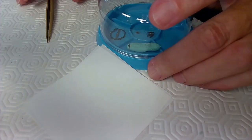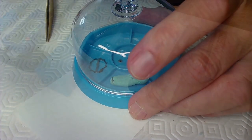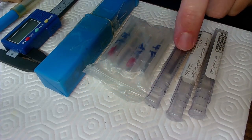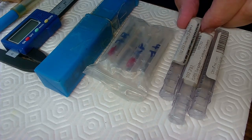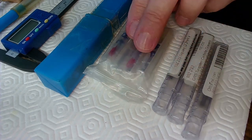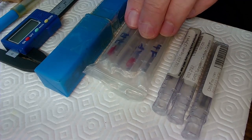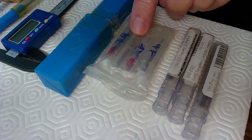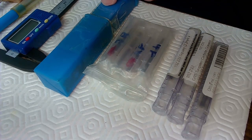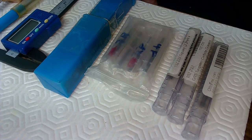So what tools do I need to cut the balance staff? The first thing I need is a set of gravers. These are larger ones with a triangular face for the initial cut. I have smaller gravers as well — two millimeter round, two millimeter flat, four millimeter round, four millimeter flat. I'll also need a stone for finalizing the pivots; I've got two stones — I'll show you those in a second — an Arkansas stone.